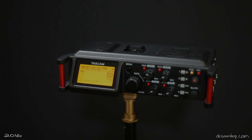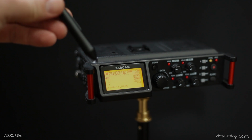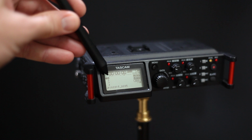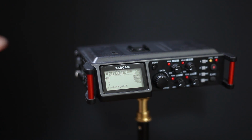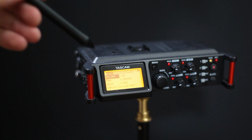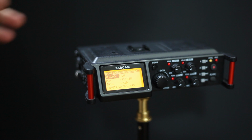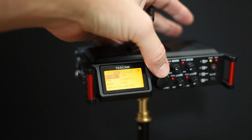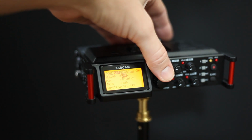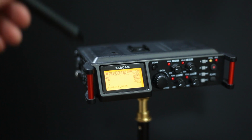In my experience, the DR-70 has been extremely reliable and easy to use. To set it up to record, you'll notice the black box around the number 1. That means channel 1 is record enabled. The little microphone symbol means that I have phantom power on there. If you go into the basic menu, you can see channel 1 is turned on. It's as simple as setting that to record. You go to channel 2, you'll see my channel 2 here is off. We go and turn that on and back out to the main menu, and you'll see the black box around channel 2 as well.